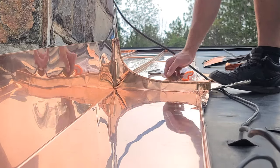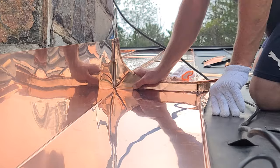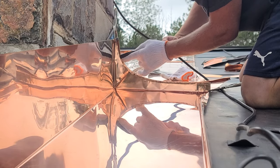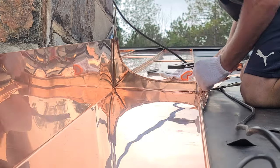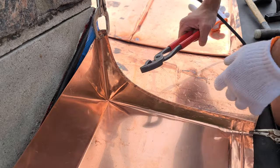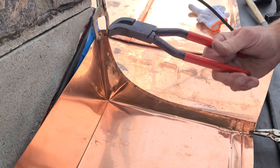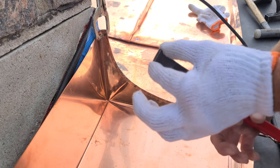We have that first lock. Now we're going to turn the second lock. So all we're doing — here's that front edge, I don't want to grab past it, I want to grab before it. So right here we got that fold over. These are nice — you can use these as well — they're bigger piccolo benders. The idea though is a narrow head. Something too bulky won't work — you don't get enough power and they're too big for this curve. You're bending too much at once for it to be a successful bend. So take these and you just bend a little at a time. I start in the middle, give it a crease, and I'm just grabbing in front of that raw edge — not grabbing over it — and I'm letting that leading cut edge make its own bend in the metal, squeezing and bending just in front of that finished raw edge.